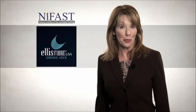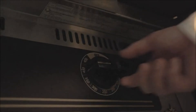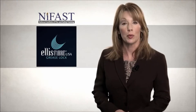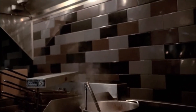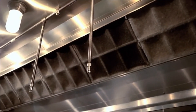The filter material must be immediately removed from use when charring occurs and must not be reinstalled until the heat source temperature is lowered or the direct flame or embers are extinguished or removed. When a grease lock filter begins to reach maximum grease removal capacity, air laden with greasy contaminants will pass rapidly through the restricted pathways in the fiber, and contaminants may pass through the filter without being trapped. Another reminder: do not cook without the metal baffle filters still in place.